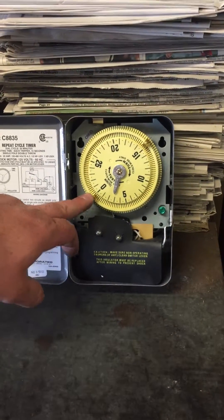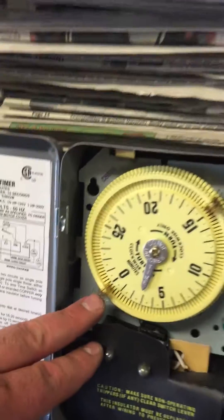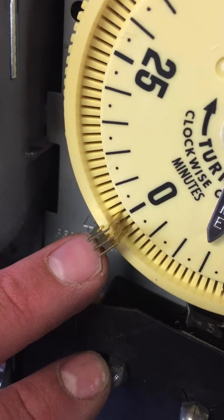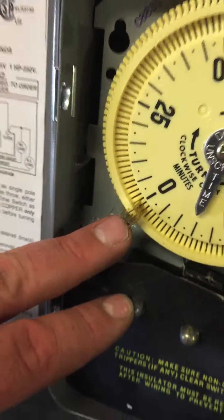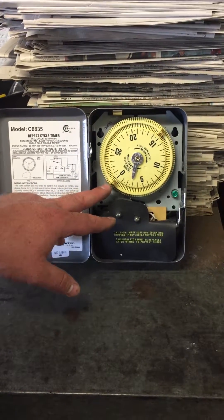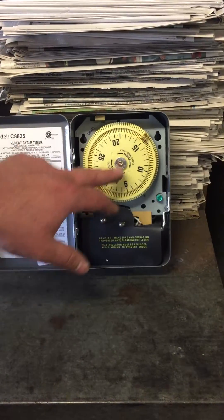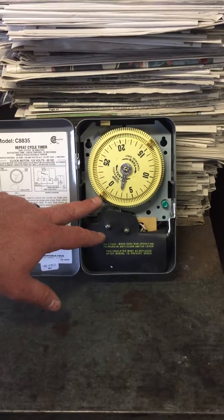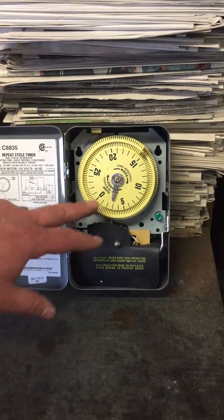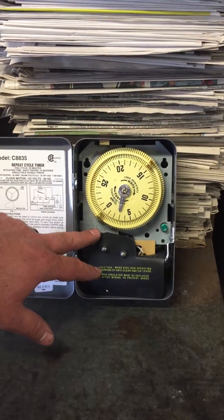For the boilers, as you can see here, at 0 and 15 we have three pins. And what that's going to equal out to be is roughly around 40 to 45 seconds. Each timer is different on how long it takes to click on the first pin. But we found that 0 and 15 with three pins works out the best as far as keeping it lit and not overheating. You can adjust them for a more fine-tuned preference.